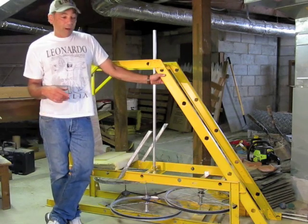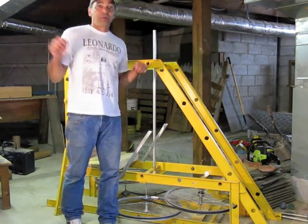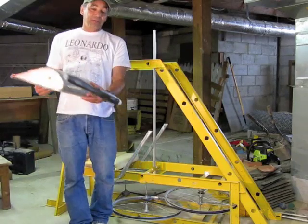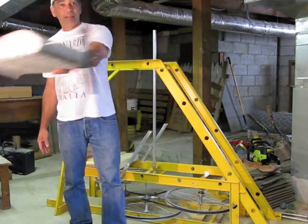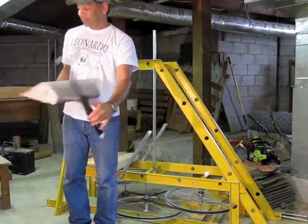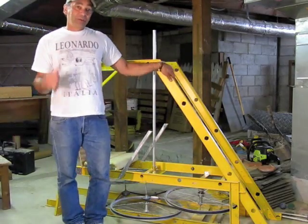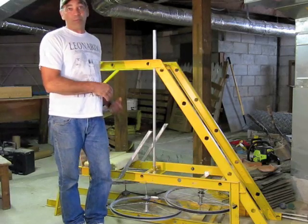My idea is to create power for the lift through tip propellers at the end of the rotor blades. Basically, it's a propeller at the end of the rotors which will spin at high speed and give it thrust, thereby moving the rotor blades around and giving it lift. The advantage of that system is I don't have to have a tail rotor, which would add more weight and complexity.